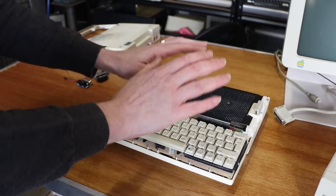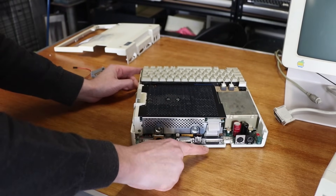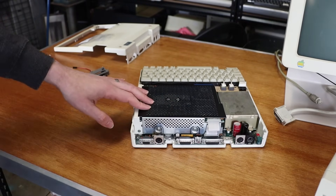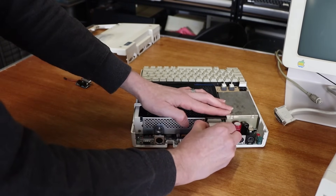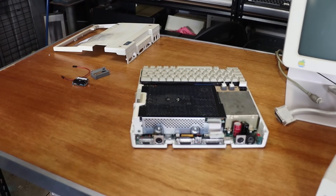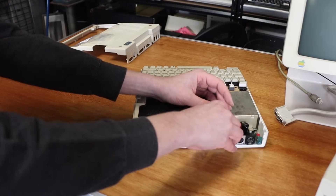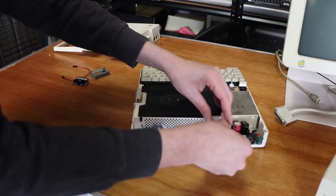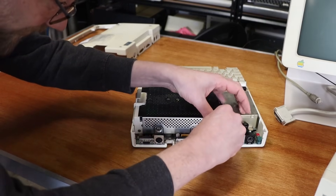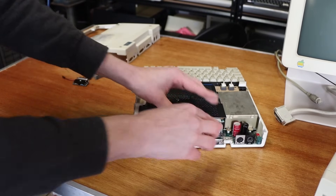My Apple IIc — some swearing and the cover off. We're going to turn our attention to the back of the machine just here. This is the internal floppy drive and this is its little cable. It's not that difficult. Basically unplug that, take the internal portion from the drive switcher and plug it into the port, then plug the cable back into it. Right, that's that bit done.